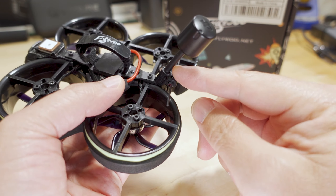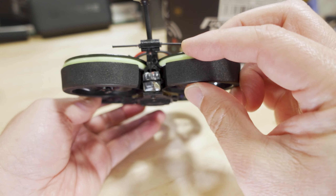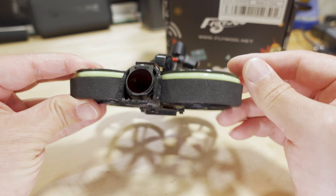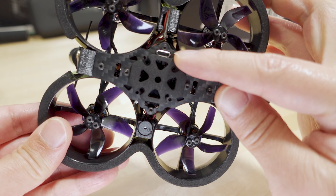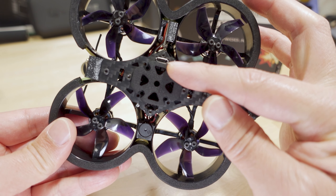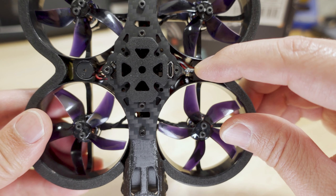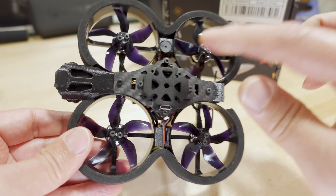You can change the recording destination in the goggle settings to switch between internal storage and micro SD card storage. They made a slightly different antenna mount for the DJI antenna with a smaller stem. The receiver in this case is an ExpressLRS receiver. There's an LED strip that goes all the way around — it's actually blue when turned on. The flight controller has a micro USB port on the bottom, it's an F405 with about seven UARTs, and the gyro has been updated to an ICM gyro. There's also a buzzer added on the side.